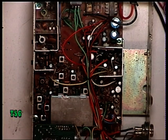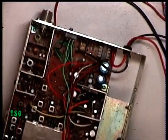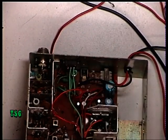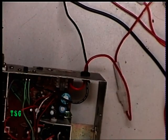We've done a few preliminary things with this radio. I found a scrap chassis here which is probably in better condition — we buy in scrap chassis and it can be very useful for hard-to-get parts. What we've done is take the switch off the scrap chassis, which is for the high/low power, and a full-length power lead with its fuse holder and grommet. So that's gone in. At the same time I noticed the protection diode on this chassis was missing.